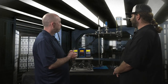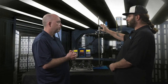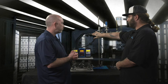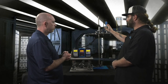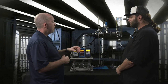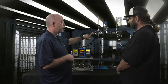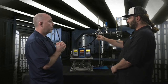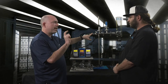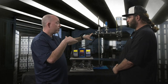For falling film or rotovaps, which sensor is the better investment? For falling film and rotovaps, definitely go with a piezo sensor. Does it measure pressure as well as vacuum? Good question — this one goes up to about 775 torr, so just a little bit above atmospheric pressure, which is about 15 psi.